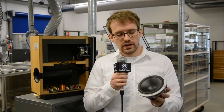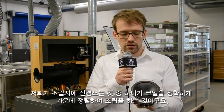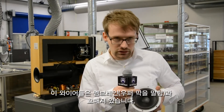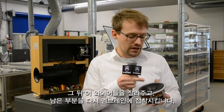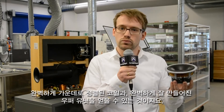These are almost final assembled, and now I can show you actually how they are assembled. Here you see the same woofer that you just saw in the drying cabinet, and one thing we do is to really center the coil. We have these little wires here, and these little wires actually pierce the membrane so that we get a perfectly centered coil. And then we clip the wires and glue the membrane again. That makes a perfectly centered, perfectly well-performing woofer.